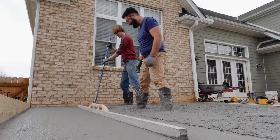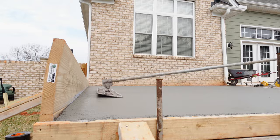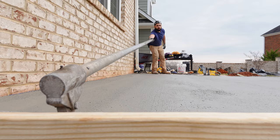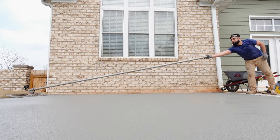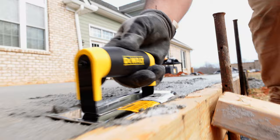That was my brother and business partner — the buggy driver today. Once we get the concrete poured and struck off, we're going to run our bull float over it, trying to push the gravel down and work the cream to the top of the concrete. This is Cory that you're seeing finishing the concrete — he's really our expert concrete finisher. He joined us about three years ago and I really let him run the jobs whenever we're pouring. He always likes to get out on knee boards and hand float the pads.